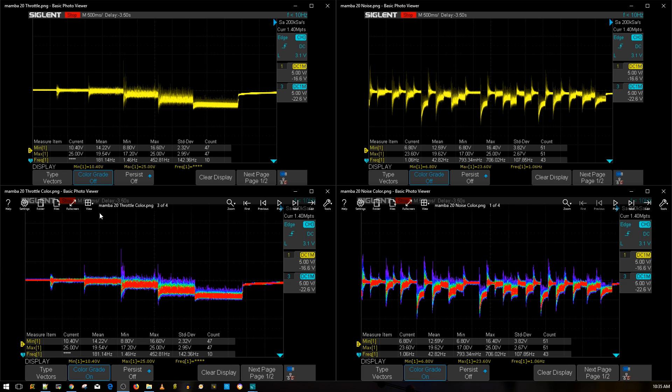If you're new to the channel: on the left side we have the throttle noise level test, which can give us an indicator of whether there will be mid-throttle oscillations. Around 60-75% throttle is the noisiest range ESCs tend to run. If the noise level is really high and going up and down a lot, you can have possible mid-throttle oscillations due to electrical noise. Here are the results at 10%, 25%, 50%, 75%, and 100% throttle. On the right side, we have the simulated aggressive flight maneuvers.